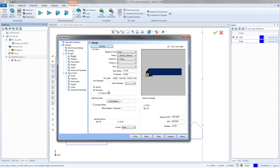So when we start switching, we can then do horizontal. If you go to orientation 1, that'd be kind of doing the OD, not the way I'm going to do it. We got number 2, so this one's going to go from the front face back. Number 3, you start getting into a backside ID kind of finishing, but not really something we're going to do. And then right there is number 4. So I primarily use number 4 when I'm working on my ID work. It's going to let the front face of that just run right in, clean up that top edge, and work. Now, we're going to leave it on vertical, and I'm going to put it back to position number 1 because that's the orientation I really need this thing in.